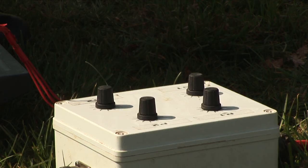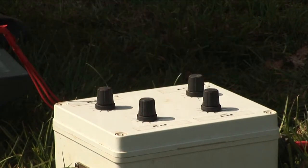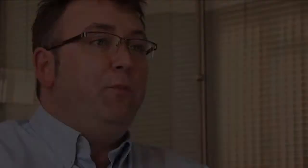The test that we undertake is called the Wenner method. This method requires us to run out four separate leads that are equally spaced apart. We measure the resistance value from these probes and then from that we can gain the soil resistivity. By increasing the spacing of the probes on the surface of the soil, we are effectively measuring the soil resistivity deeper in the ground.